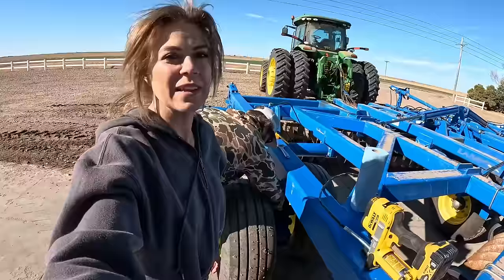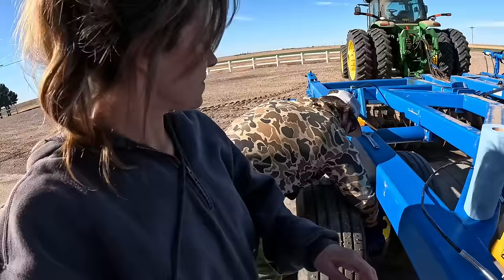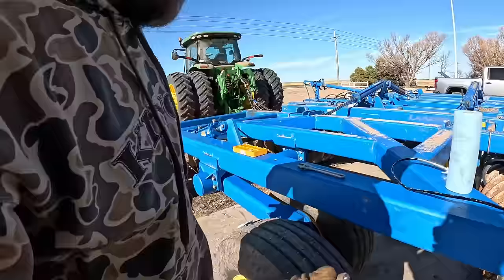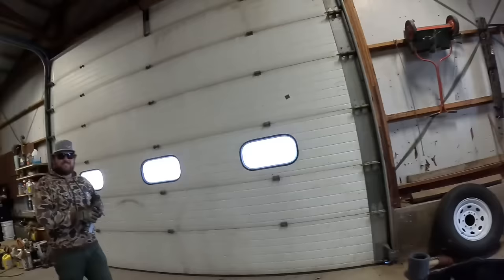After we fix things. I didn't break anything yet. Replacing a greaser is what you're doing, just because you think one is clogged or broken - it won't take grease. It's hard to say - sometimes it's the zerk, sometimes it's right under the zerk. Oh watch your hoodie - there's grease on the left side of that tire. The end broke off and it plugged the hole - oh that's why it won't take grease. Yeah, they'll do that sometimes, that'll happen on your bigger jobs.